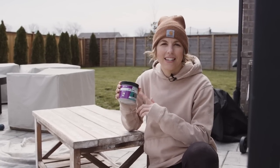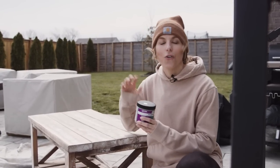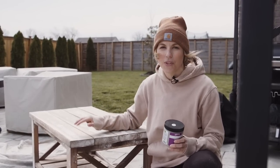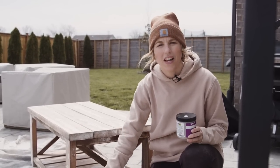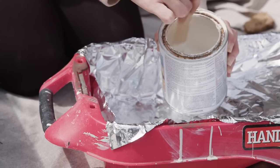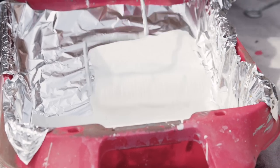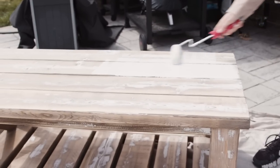If you've been around here for a while, you've definitely seen me use Beyond Paint before. It's an all-in-one — it has a primer, paint, and sealer. It's really easy for the average DIYer and doesn't take a lot of skill. Normally I do not have to prime with this paint, but today I do because this table is knotty pine. You could see brown seeping through those knots — they are going to leak and have tannins bleed through your paint. So for insurance, to make sure my paint looks really good, I'm going to do a stain-blocking primer specifically to block wood tannins and seal these knots before I add my paint.